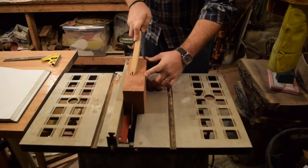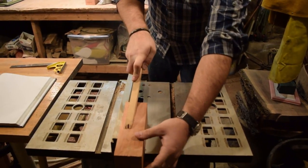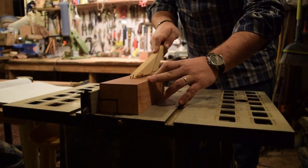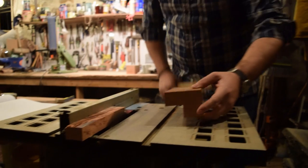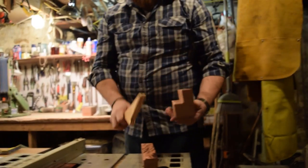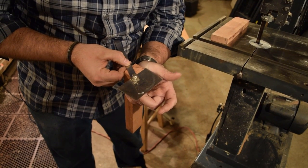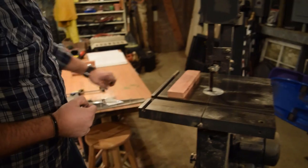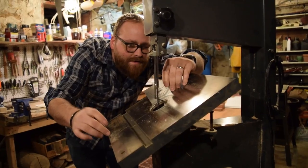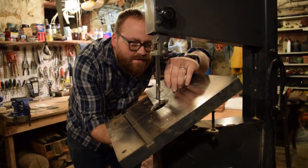We're going to make a small piece of wood and make sure we can cut it on the bandsaw. So that's at 60 degrees — now I can set my bandsaw. I can set this to 60 degrees and check it against the blade. Line up the blade, now that they're both at 60, tighten this just a little bit.